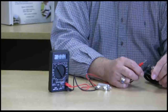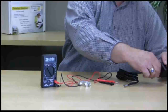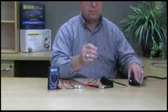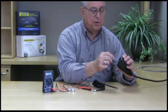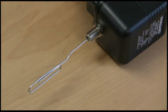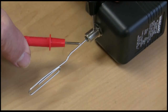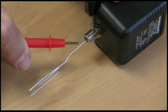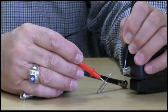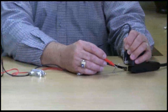If you did not have voltage at the end of the cable, I would suggest using a paper clip inserted into the wall transformer and measure the wall transformer directly. The threads are your negative lead, the paper clip is your positive lead, and we should have somewhere between plus 18 to plus 27 volts DC.